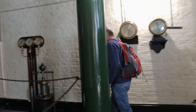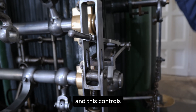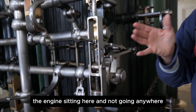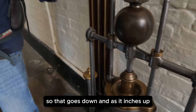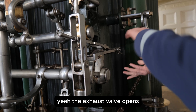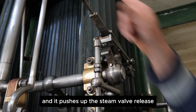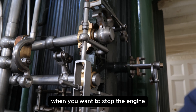As soon as the exhaust valve is closed the equilibrium is released and the engine starts to gently go back out — that's from the weight of the pump. Now this rod from the cataract controls the pause at the end of the outdoor stroke. When the pump's gone down the engine sits here not going anywhere, and this rod is inching up. The first thing it does is trip the exhaust valve — the exhaust valve opens, the vacuum comes on, the engine might quiver. It keeps rising and pushes up the steam valve release, the steam valve opens, and the engine comes indoors.